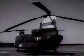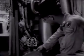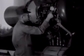The Chinook is a complex but rugged aircraft. All of its components are designed for long and trouble-free life. Let us review some of its unique systems. Its loading ramp provides easy access to the large cargo compartment equipped with a hydraulic winch, which can pull cargo into the helicopter through the ramp opening or through a hatchway in the cargo compartment floor. An 8-ton capacity hook is provided for sling load operation. Ease of servicing and maintenance were prime considerations in designing the Chinook. Work stands and ladders are not needed. All panels are hinged in place. All regular maintenance can be performed with tools from the standard mechanics toolbox. The drive shaft, hydraulic lines, electrical cables, and control rods run through an easily accessible tunnel at the top of the aircraft.